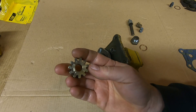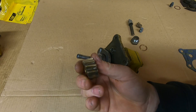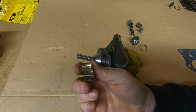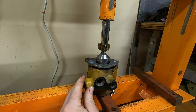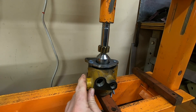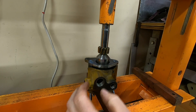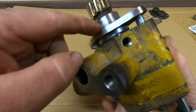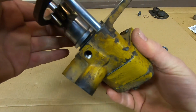I think I'm going to reuse this old bronze gear again. Do I trust the steel gear more? Yes. But on a coolness scale from one to ten, we're at about an eleven here. I really like this early first gen tech that's on 1113. Besides, taking into account the modern oils and the very limited amount of hours 1113 is ever going to accumulate from here on out, I can tell you I'm never going to wear this the rest of the way out. So we're going with the bronze gear. Very carefully in a controlled manner, this special tool allows us to press this gear on with some degree of accuracy. Don't put any more pressure on it than you need - just go until it bottoms. Now release tension on the tool; that will allow that spring to drift the seal retainer out to the gear. The gear is holding everything together now.